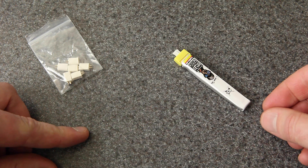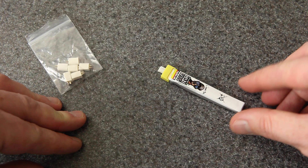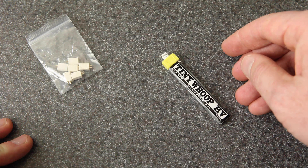It's actually a lot more difficult and more dangerous because you're working with the tabs right there exposed. The actual tabs that come out of the battery are really fragile and easy to damage. I ruined one of these batteries already doing that. So if you're going to do it to 1S batteries, I recommend you get the ones with wires like I showed here, and only do it to stick batteries if you're really confident in your soldering.